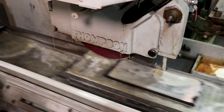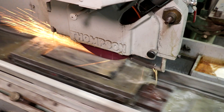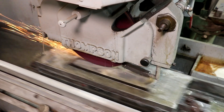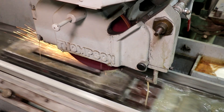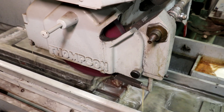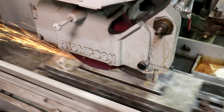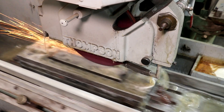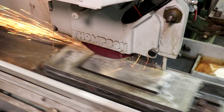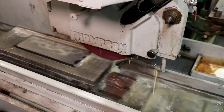Looks like we've got the top cleaned up here, still just a little bit on each side. This part down here in the middle is fairly deep so we won't be able to get that out — I'm not going to worry about that. I would like to really get it cleaned up to the edges. Let's see how far we've gone here — a little over 40 thousandths, which is a little bit more than I was anticipating. But it takes what it takes. That's not counting any wheel wear, which I'm sure we've got some. There's plenty of metal there — we're going to get it to clean up and we'll be done.